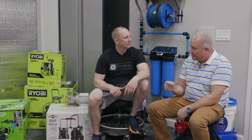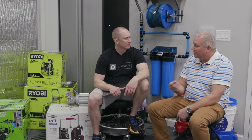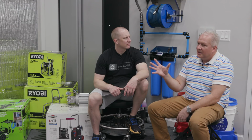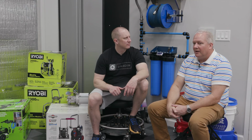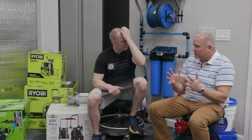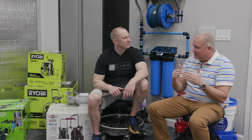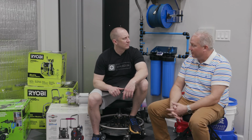So each pressure washer manufacturer is required to have calibrated gauges, pressure and flow gauges that are calibrated annually, and so you're doing most of your testing internally to make sure that they are meeting the PW101, and then you have your annual audit through Intertech, which is then verifying it. And most of the times we invite Intertech to come to our facility. Some of the pressure washer manufacturers may do it differently, but they'll come out and verify that our gauges are actually within 1%. It has to be 1% PSI, 1% GPM accuracy, and then they'll even do the testing right at our facility sometimes.